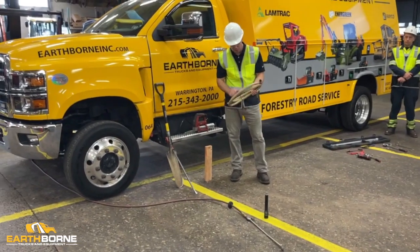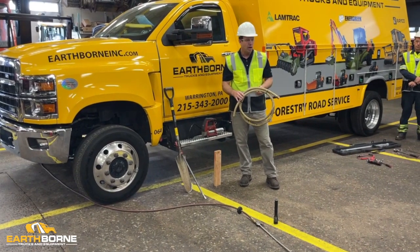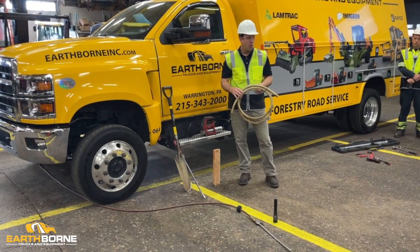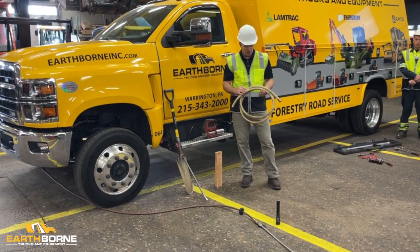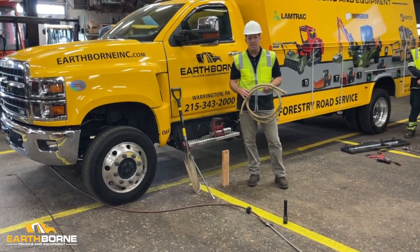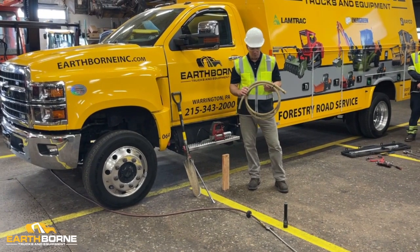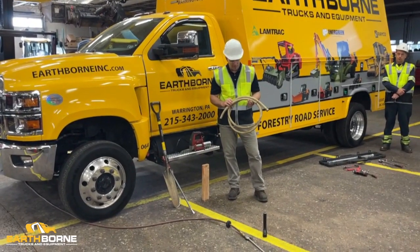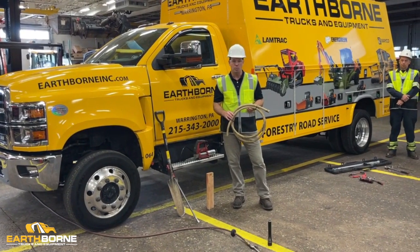I also show a garden hose. The reason I show a garden hose is just another warning. There's a lot of areas on this machine that you've got to keep clean. We do say that the best way to keep it clean is to tilt the cab, open up the engine compartment, and use a pressure washer, but be careful when you use a pressure washer. The reason is there's a lot of electrical components in there. So sometimes we'll take a plastic bag and put it over the computer. We always disconnect the battery isolator that we'll show you, but there's some areas in there where you're just going to rinse. You're going to pull the belly pans out and rinse around it. So keep in mind that there are some areas that shouldn't be hit with the pressure washer.